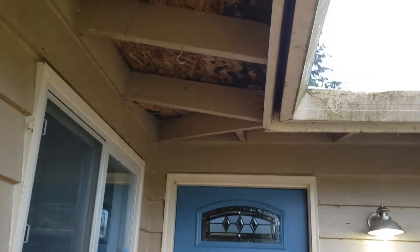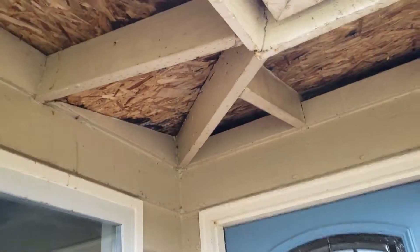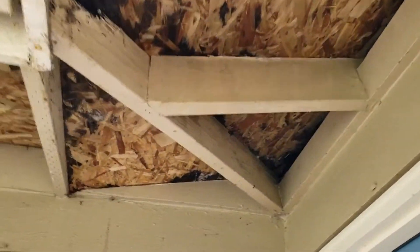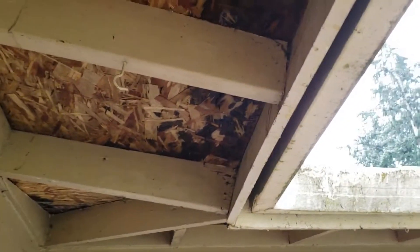This is Brandon with Manson Home Inspection — this is a one minute home inspection. We're out in Federal Way doing a roof inspection. We're looking at this valley on a pretty low sloped roof with composite shingles. We can see there's water staining going down the valley, which tells us there's a leak in the roof. The roof is only two or three years old.